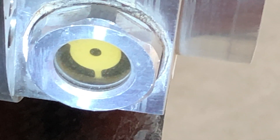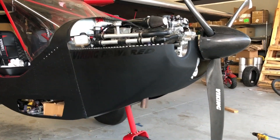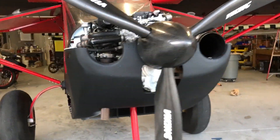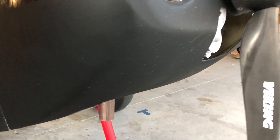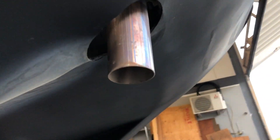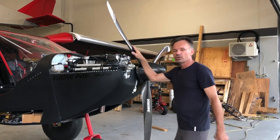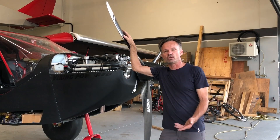Overall, just a very successful flight. We fly hundreds of hours on these engines and constantly check everything — ignition timing, valve timing, exhaust pipe, and compression. As you can see from the 20-hour flight, it's an absolutely perfect mixture — just a tiny bit of lead but no soot, so the engine is running nice and clean. Another quick check of course is to do a compression check.